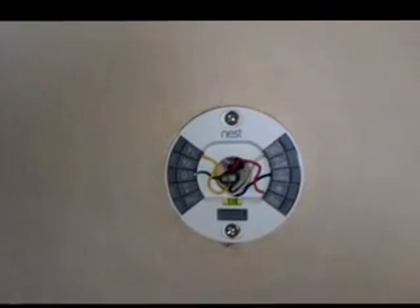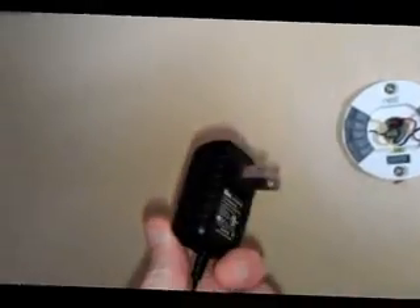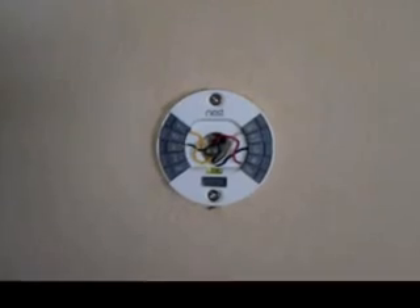Make sure you turn your power off before you do it, of course. Now if you don't have that C-wire inside the wall — if you don't have another wire you could hook up to the C terminal on the thermostat and the furnace — there's another option. You can get what is called a 24-volt thermostat AC transformer that basically just plugs into any outlet. You'd run two wires — this would act as though it was the C-wire. The only problem is you'd have wire coming down unless you put it in the hole and fished it through the bottom of your wall.